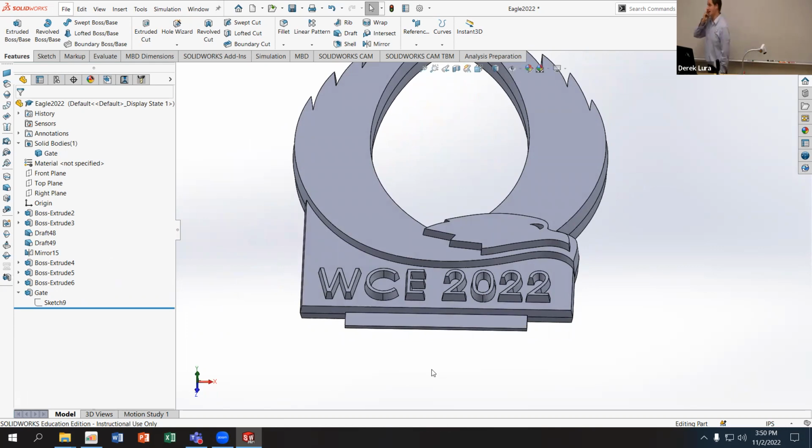And the next thing I'm going to do is design the delivery system for this. I want to make sure I have capacity inside my delivery system to hold an amount of fluid. How much fluid? Probably something reasonably comparable to an appropriate volume of excess material you would want to have for your part. 10% is kind of a good amount, but you can eyeball these things. It's not super critical. You just want to make sure that you know the part is filled when you can see that that reservoir is no longer draining at an appropriate rate. So this is an overflow to make sure your part is full. Sound good?